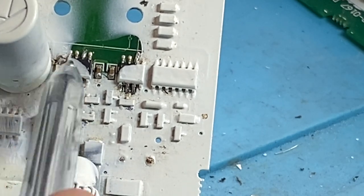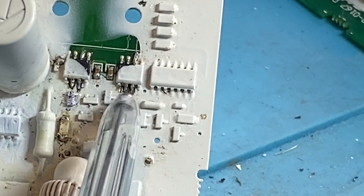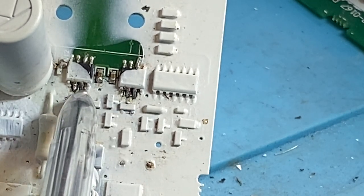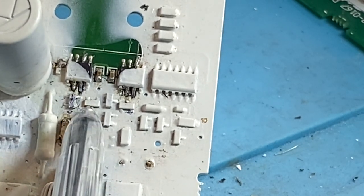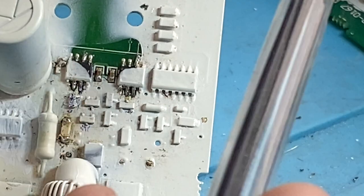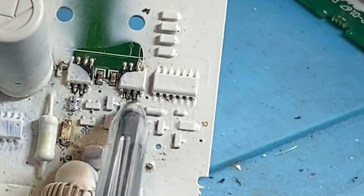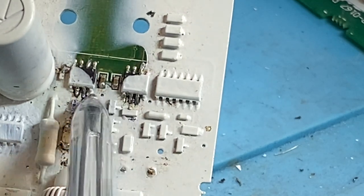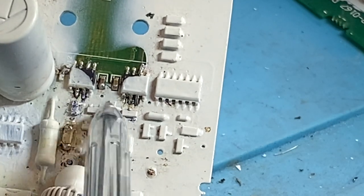And what that does is stop these things losing their bias current, and you have a problem when the receiver comes back on, they may not be stabilized. So you've got bias current when the receiver stage is on, because that MOSFET's on, that MOSFET's on, the N-channel ones on the back of the board are on, they're connected to the coil to ground. So you've got your bias current available that way, but when it's in transmit or any non-receive mode, it wouldn't have any bias because everything is back-biased.